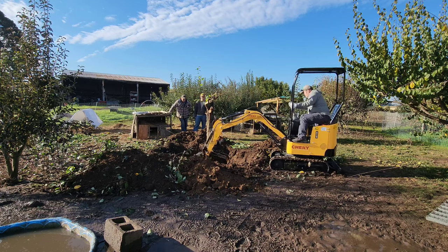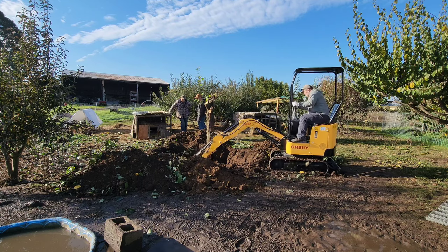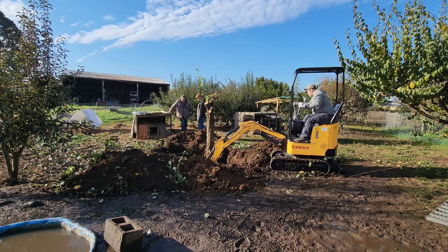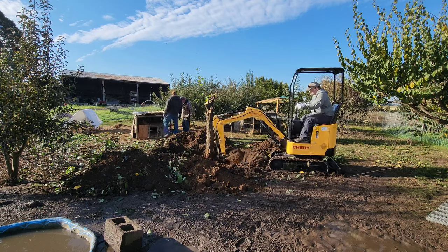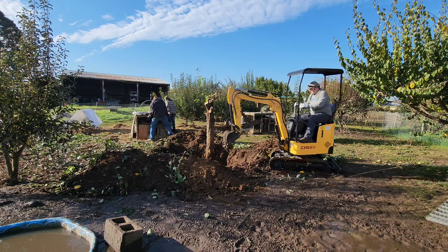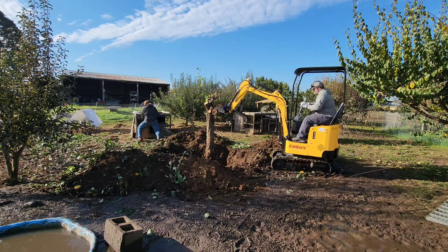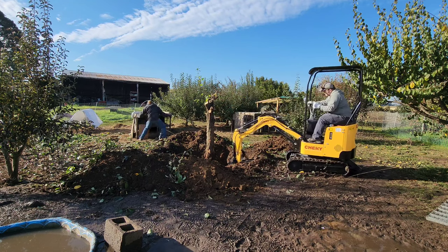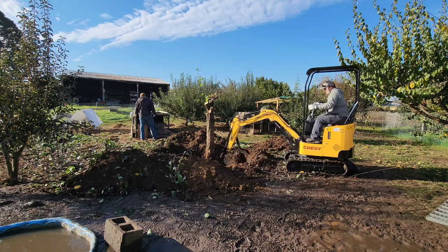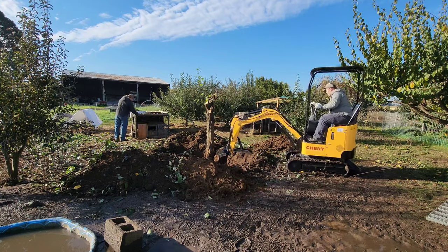Think of it like a brake system in a car. You have the master and slave cylinder. It's a similar concept to that. There's a little bit more to it. Some of them have to have power from the motor to work, but that's the general concept, the master and slave cylinder. What that provides is a little bit smoother operation. So that's pilot control in a nutshell.